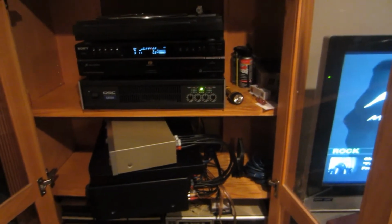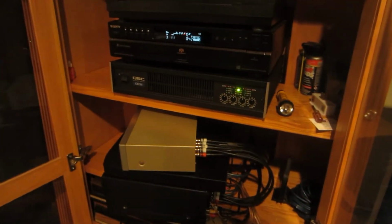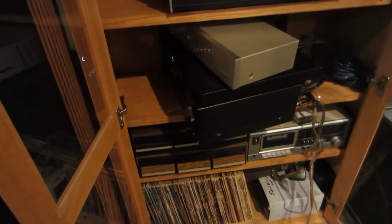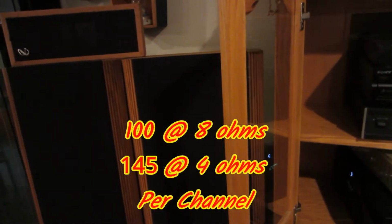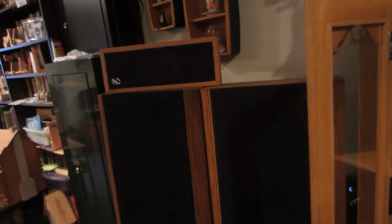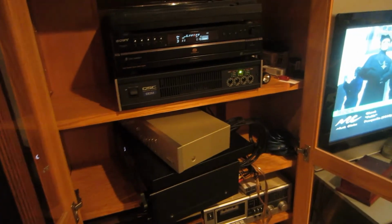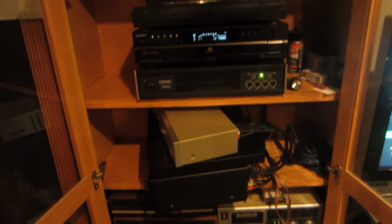So I've gone from running off of that speaker to feed the little tweeter. I've gone ahead and run separate lines off of my B speaker lines out of my receiver, which puts out about 100 whatever watts per channel. So these guys only take like 5 watts per speaker. The crossovers in them are good for RS3As, which are good between 50 and 150 watts a piece, so the crossovers are good. There's no problems there. And I think I've pretty much solved the situation because, as I said, now that I've got them plugged back into my receiver, they sound as good as they used to.